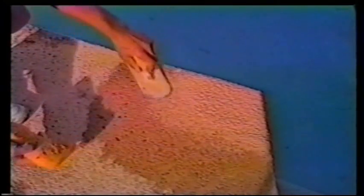Keep wiping the trowel, and it's easier to do it if you do that. Otherwise, it starts slurring and you will need to finger tap it again. No reason to waste time. Just keep a clean, moist sponge on your trowel. Now that it's gotten firm, we're ready to go on with the rest of the repairs.